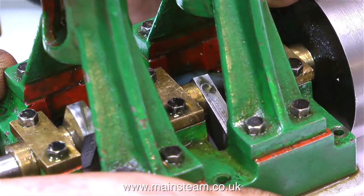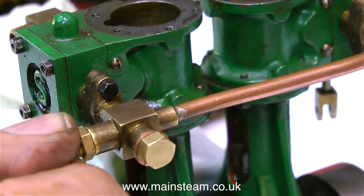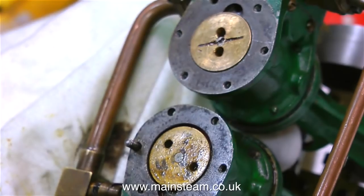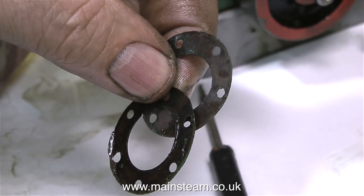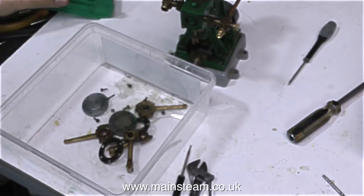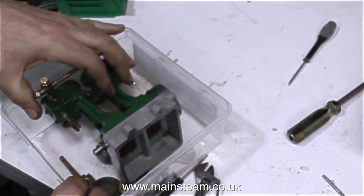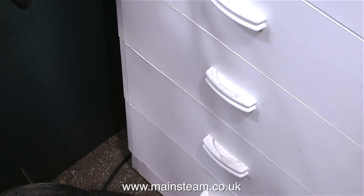So what else is wrong with the engine? The crankshaft is scrap. The thread on the steam inlet manifold — the one that goes into the steam chest — is very sloppy, and that's going to need a lot of thread sealant or PTFE tape. The pistons seal fine because I put silicone O-rings on them, but I would really make new pistons as they both look very different and are very odd sizes. The threads that locate the crosshead pins on both connecting rods are stripped. There is one good thing — two of the gaskets are quite good and I would reuse these. For the moment, I'm going to tip all the contents into a plastic container, including the main engine itself, and deposit it in my drawer where I put scrap engines — alongside another scrap double ten that also came from an internet auction site. I really do hope this video is useful to anyone contemplating buying a model steam engine from an internet auction site. Thanks for watching, and I hope you found it useful.